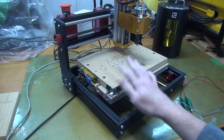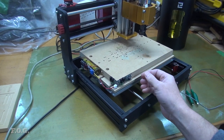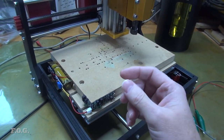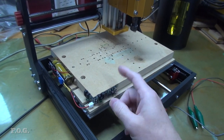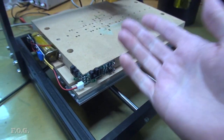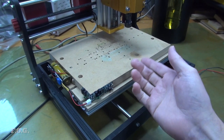So with all that, where are we with this cheap CNC PCB making methodology? Well, I need to do some tweaking and some testing to get the pad clearing and text overlay a little bit better, but I think this is really just a matter of time. I don't see any roadblocks here with that process. I also get the impression that this new probe sensor I made is more of a convenience than a must-have. Don't get me wrong, the convenience benefit alone is not inconsequential, but only if the precision of the CNC is improved could we expect the full accuracy benefit.